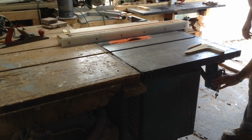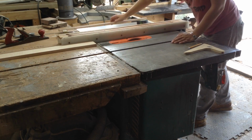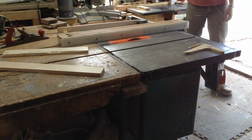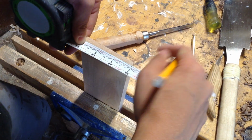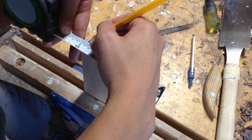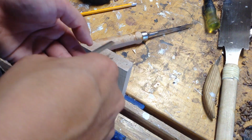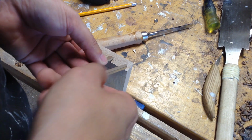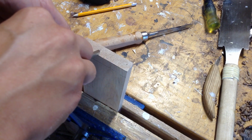So to make the drawer, I'm starting by slicing up some maple. I had this maple in my shop. This drawer is nice and small, so since I already had this maple, it was nice. I could use it without having to charge the customer to go buy some new products. And I'm going to put through dovetails in the back. This material is about 5/8 of an inch, and I ended up planing it, but I don't show it on camera. So in order to start the dovetails, I'm using some calipers.